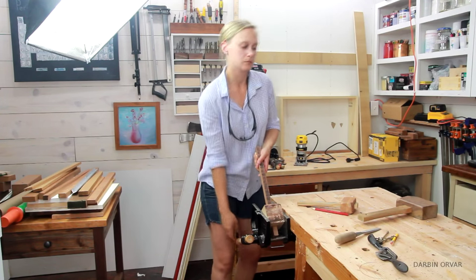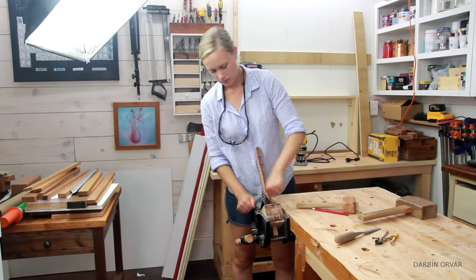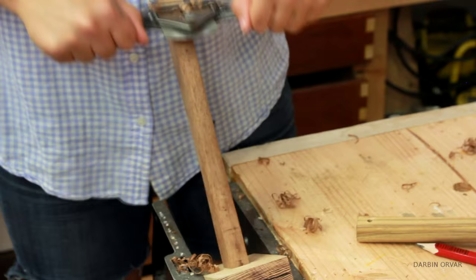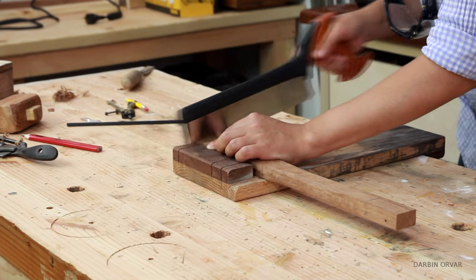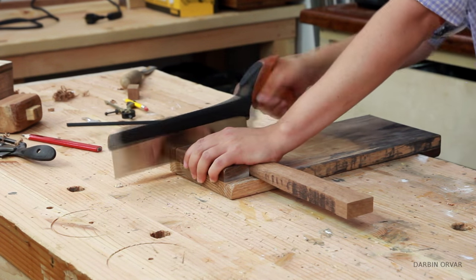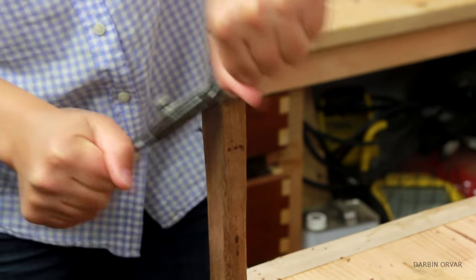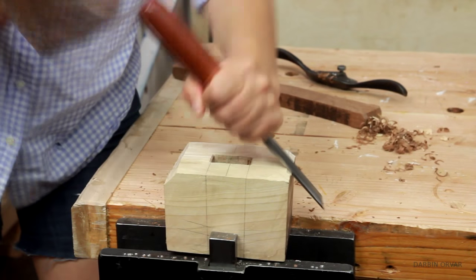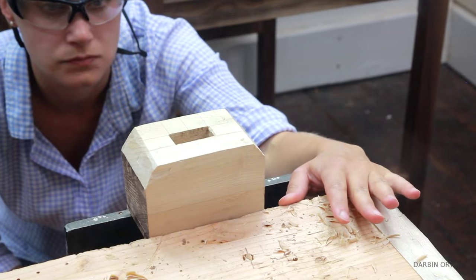Now it's time for shaping. I'm starting with the handle and using a spokeshave to round the corners, paying attention to grain direction. When the handle is fitting in the head, I'm marking out where it needs to be cut on the top and on the bottom. And shaping the top, adding some beveled corners, and smoothing out the bottom too. Next, shaping the head — here you can really do whatever you want. For this mallet I wanted some shape, so I chiseled down the sides slightly, then did some planing, finishing up with a spokeshave on all the sides.